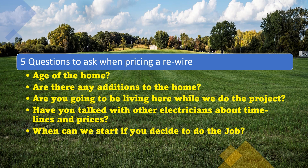The first question is the age of the home. The age of the home tells us so much with experience. If the house was wired in the thirties and forties, you can expect real metal boxes up in the ceiling — typically full size boxes. But if it was previously in the knob-and-tube era, there might be thinner boxes that you'll definitely have to change. From that era, you might also expect rock wool insulation to deal with. In the forties and fifties there are other tells — maybe the type of framing, which could be solid oak. All these questions about the age give you different cues.